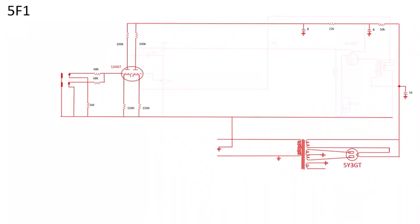The audio signal coming off the plate of the first preamp stage encounters a coupling capacitor on its way to the second stage. The coupling cap blocks DC and lets AC pass through — the audio signal is AC, and we don't want high voltage DC on the grid of the next stage as it will interfere with biasing and probably damage the tube. Coupling caps also work as high-pass filters; the lower the value, the more lows are filtered out. We then reach the volume pot, where a certain amount of the signal goes to ground and the rest goes on to the next stage, which amplifies the signal again.